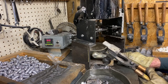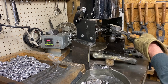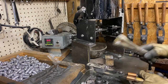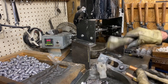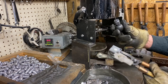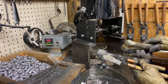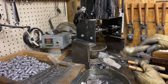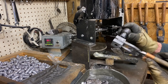After we've fluxed our pot, the next thing is to heat our mold so the bullets come out with uniformity. This may take several attempts or it may be pretty fast — this particular mold has been used many times. While heating the mold, I'll show you the process. This is a hollow point bullet: I take the pin out, lay it in its cradle, and in order to get the bullet out you need to be very cautious — never hit the mold, always hit the handles. That opens it up and the bullet will come out easily. That first bullet is discarded. Put your pin back in.